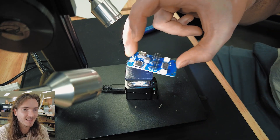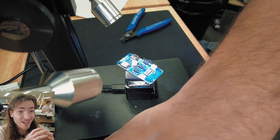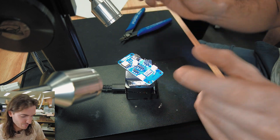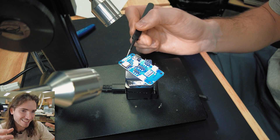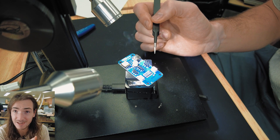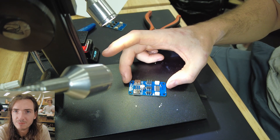We've got parts down on two units and it's time to bust out the hot plate and solder them. These tiny MHP hot plates are marketed as a preheating hot plate for hot air rework — you can have your board at an elevated temperature and then bring in your hot air gun to rework it. They do an immaculate job for prototyping and just the whole reflow operation — very, very useful. They are teeny tiny though, kind of the perfect size for a single unit Pucadev module. For these longer ones, I just have the board spanning the hot plate diagonally so it doesn't fall off quite so easily, and then I nudge it around to pull that heat from one end of the board to the other. It's always so pleasing to see when those little granules start to turn into a liquid and everything just aligns into place with surface tension. Very satisfying. Just giving the board a once-over looking for any problems we can catch now — if something needs to be reflowed, we can reflow it and fix any open or closed bridge.